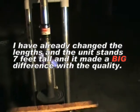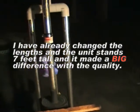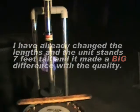This is nothing but one-and-a-quarter inch fence post — the hollow stuff you can get to put up fence with. Much cheaper than going and buying an exhaust line for a car. I've got three-foot sections on each side, and I'm going to change that to either five or six foot sections because I feel it will allow the gas to cool even more. The more you cool this gas down, the better the unit is going to work.